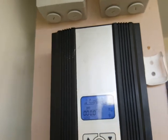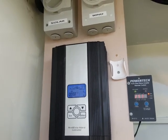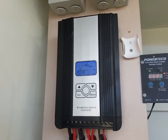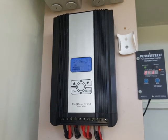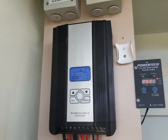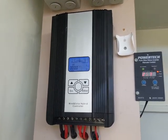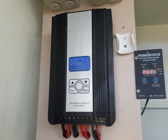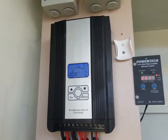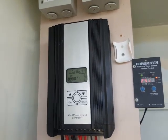So how this controller works — this trailer is actually designed to demonstrate our wind solar hybrid streetlights. How it actually functions is that at night time, when the sun goes down, the solar panels stop producing power. The controller picks up that there's no power being generated and it goes into night mode, and that's when the lights automatically come on. The wind turbine itself, so long as there's wind, will generate power — but only when the batteries need power. When they're fully charged, it just won't go under load. That's pretty much how it works. It's a great concept and we're super impressed with it.